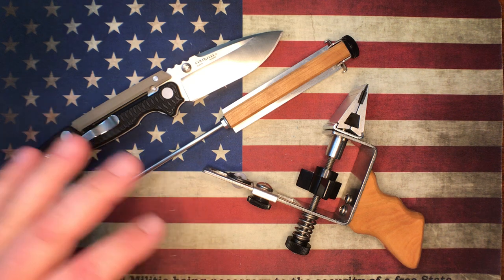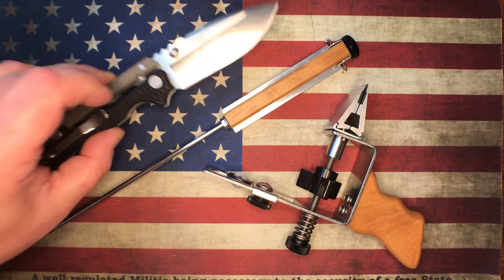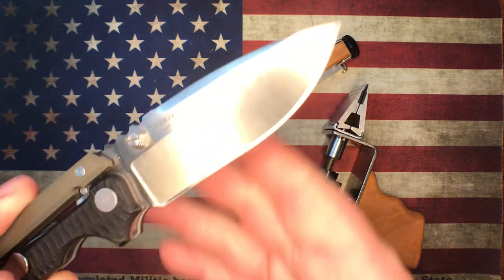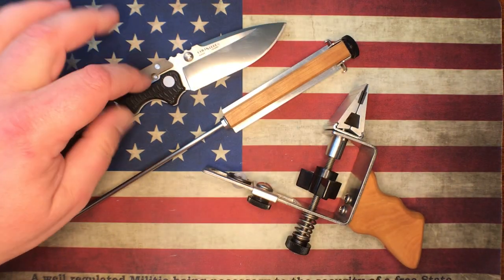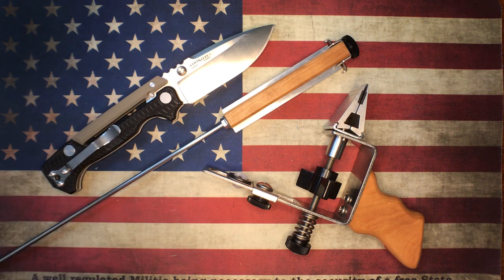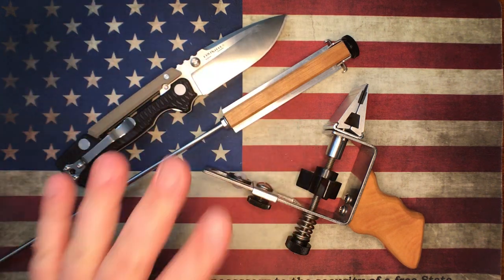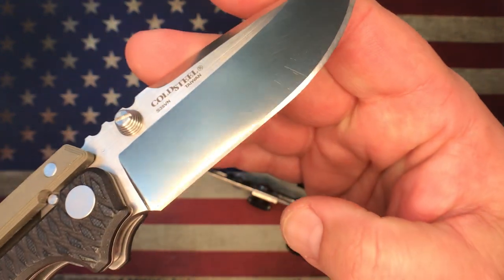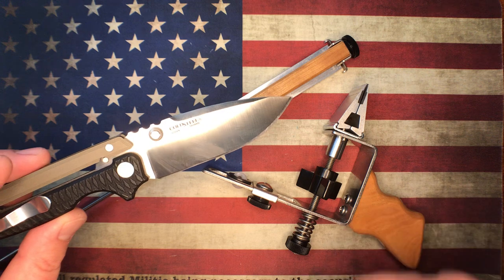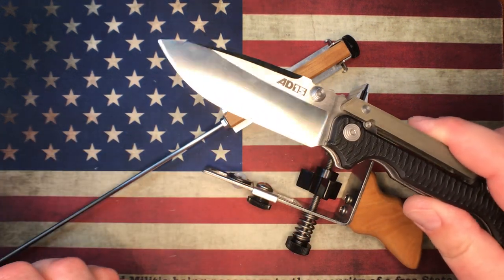A bunch of people were talking about the difference because I used the natural stones with the Raizen and used diamonds with the KME. I used what is preferred for those stones — the Cold Steel 8015 with the KME, which is an S35VN, a powdered super steel, and that's what those are intended for. And I used a non-powdered steel with AUS-10 for the Raizen Pro — I used it the way they intended it to be used. The edge on this 8015 looks a little nicer — that could be a function of the diamond stones versus natural stones, or just the way the steel takes an edge.